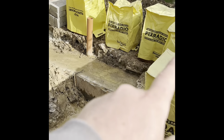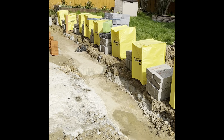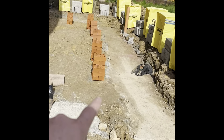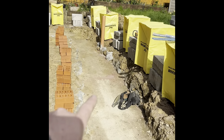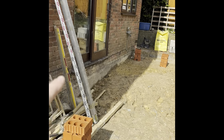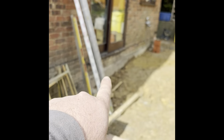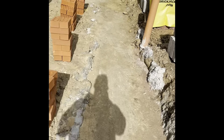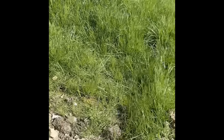Right, we are at Crowborough on the new extension job. I'll flip the camera around - the lads came here yesterday, bumped out bricks and blocks, got some engineering bricks. We've got two courses of engineering brick internally and then we're going to roll the damp out. Then we've got block and beam flooring going in, so we're going to punch holes in this existing building. Beams are going to come across and sit on here.